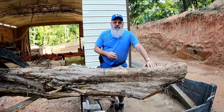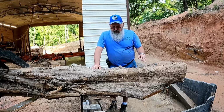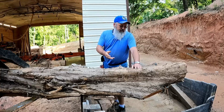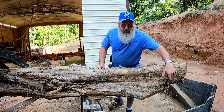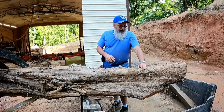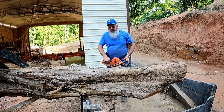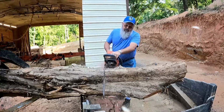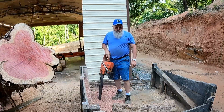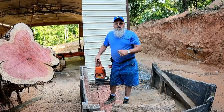Anytime we're sawing and we get something that is too short to go on the forks but needs to be thrown away, we can walk over here, throw it in the box, and we don't have to pick it up again. The other thing is like this log. Customer brought 3 logs. He's got an 11, an 11, and a 13.5. And this end is not very good the way it tapers, so I'm gonna saw it off to make them all even 11s. The stacks will work better, and I don't wanna have to pick it up because that's a pretty sizable chunk of wood, so we're gonna saw it off, put it right in the box. Just that easy, and I don't have to hurt my back trying to move it. So we're gonna let Matthew get this and load it up, and we'll get sawing it.